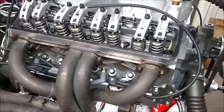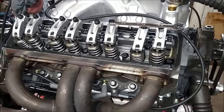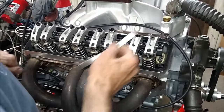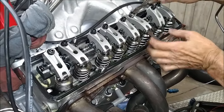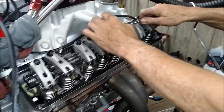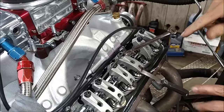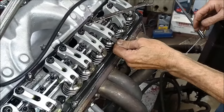Now, the way you adjust these — I'm going to get you to do this after I get through. Let's say it was off and I'm going to readjust it. Loosen the nut, loosen the center set screw. There's a pretty decent drag. You can leave it a little bit loose, but see — when you hold the set screw and tighten the nut, it's going to get looser because you're taking out the slack in the thread when you tighten the nut.